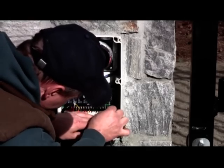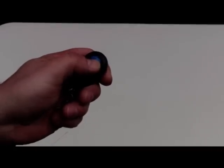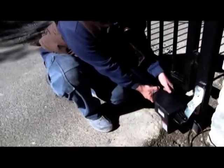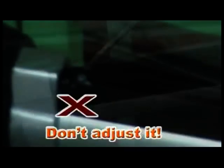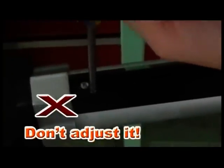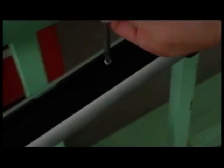You may also contact your dealer to order the power cables. The remote control has to be programmed for operating the opener before you set the control board. In order to set the closed limit easily, you may turn over the opener and insert the manual release key again to lock the opener. There are two limit switches in each opener actuator. The one close to the motor is called the near end switch or open limit switch. The other one, located near the moving rod, is called the far end switch or closed limit switch. The near end switch comes from the factory already fixed; however, if you need to adjust it, remove the limit screw and move the switch slightly. The desired closed position is reached by adjusting the far end switch, which can be moved over a fairly large range.